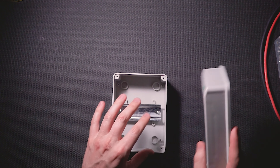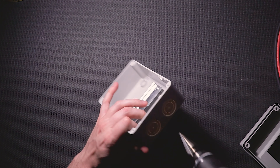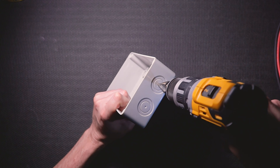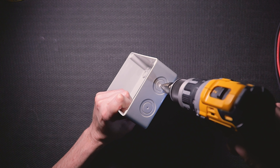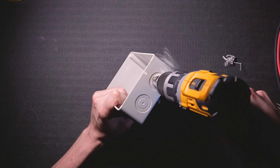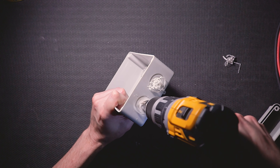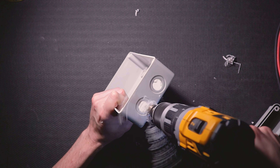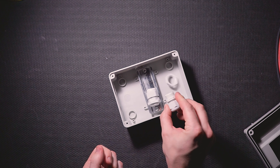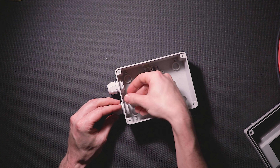I'm going to use a step bit and drill to drill the holes into the DIN rail enclosure box for the wire entry glands on the bottom. Since this doesn't need to be waterproof, it's fine for the wires to just share the same wire glands — incoming wires in one gland and outgoing wires in the other. If you're going to be installing multiple breakers into this box for a system with multiple charge controllers, be sure to offset the wire glands so that you could fit two additional wire glands in the box. I'll show an example of this in an upcoming video, so be sure to subscribe.